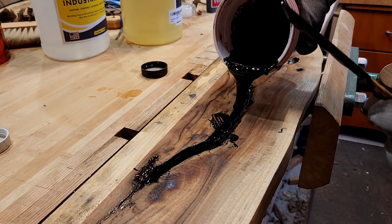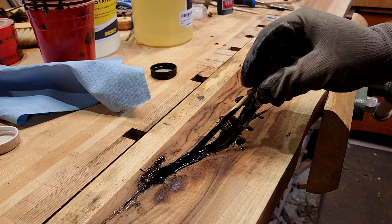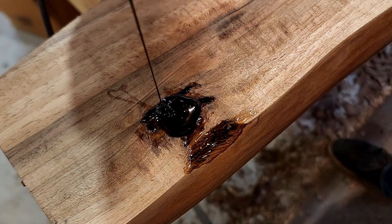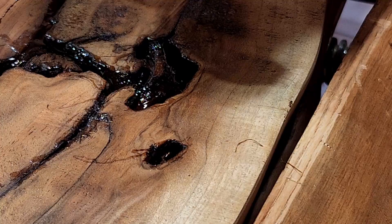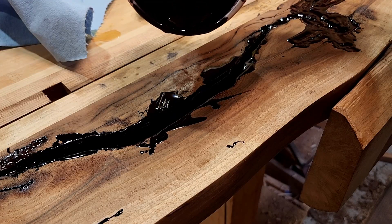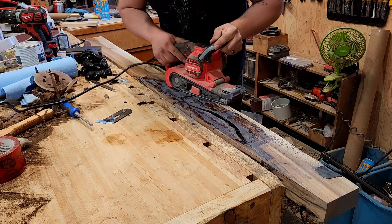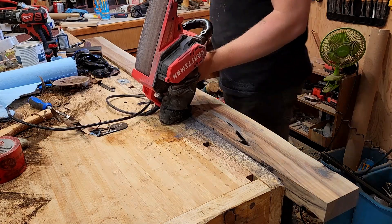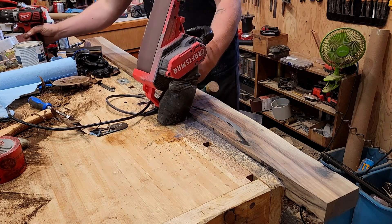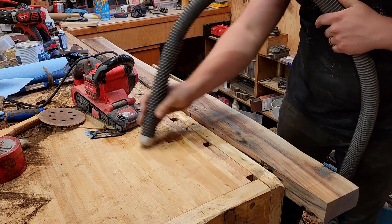As I said, this piece of wood really is priceless — I'm not going to have any other opportunity to use a piece that has a bit of history with the family and put it in my own home, so I'd like it to go well. Here I've got the first dose of epoxy in there, using a liquid dye — it's black. I actually bought it when I was refurbishing a guitar, so I'm not sure if it's something you'd normally use with epoxy, but it definitely worked really well and gave a very jet-black look. The epoxy is fairly thick so I did it in a couple of pours in those little red cups. When cleaning it off the belt sander, I noticed the drill still had the wire wheel on it — it worked fantastic, so I do recommend that as a tip if you don't have the proper tools around.